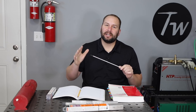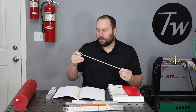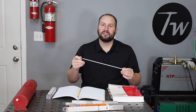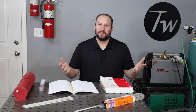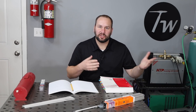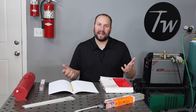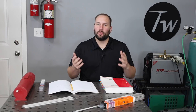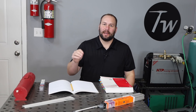What's special from a materials perspective about rods like this is that they can deposit a really low hydrogen content. However, if there's a bunch of moisture or water absorbed into the flux coating — water, H2O — that becomes a source of hydrogen. So that can end up depositing some amount of hydrogen, and you won't get as low a deposit as you otherwise could with this type of electrode.